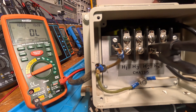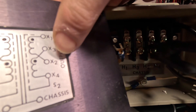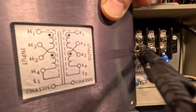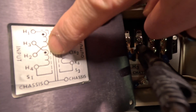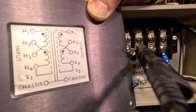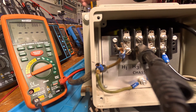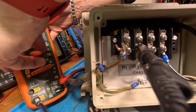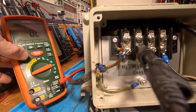We checked H2 to X3 — that winding is okay. Now we're going to check H3 with the screen to make sure that winding and the screen are also isolated from X2. I moved over here to H3. Let's lock it. Okay, there we go. Let's unlock that.